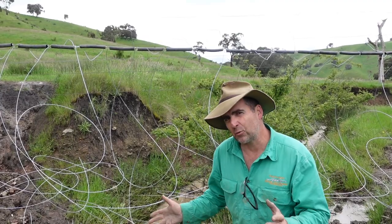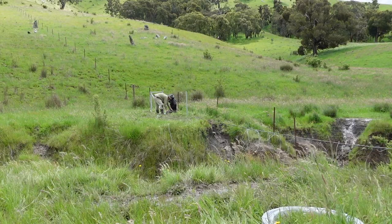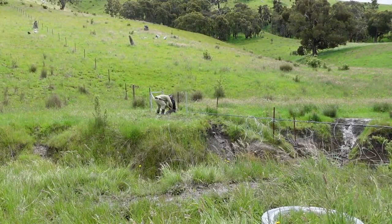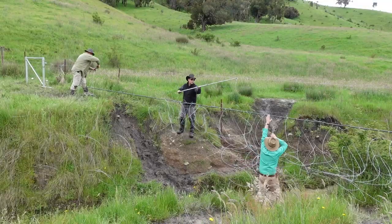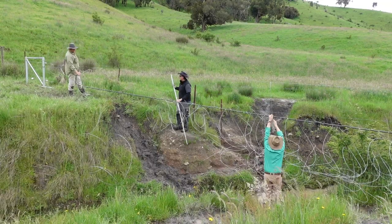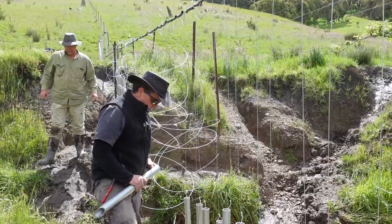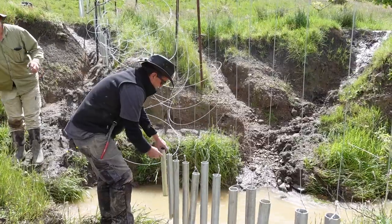And then we tied off the medium tensile wire into several meter sections between each of the spaces. So we're looking a little bit messy at the moment. We've only half completed the job. We've got end knots to finish off. We left them loose so that they could be slid across the high tensile wire that's supporting this floodgate. And then we've got our spaces in place and our medium tensile just loosely held in place where we want it to fall. The next step, of course, is putting our large galvanized pipe onto the end of each one of these droppers to hold them nice and straight.